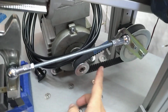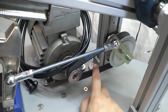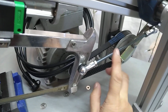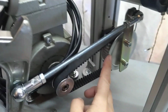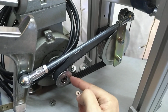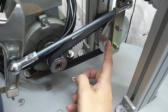And I have the motor there, I will talk about the motor in a minute, and I use this belt, HTD5 belts, that I also used on my CNC lathe, and it's perfect. And it just, as you can see, moves perfectly, and there is no possible way to slip on this. This pulley I actually pulled off of my lathe because I had it as a spare, and it was just luck that it was exactly 40 millimeters, the size of the motor shaft.